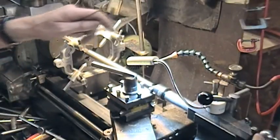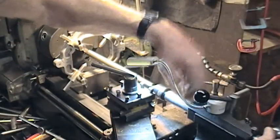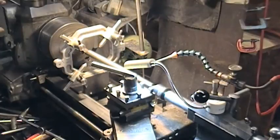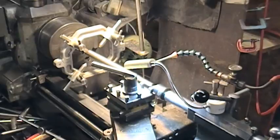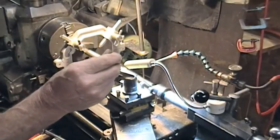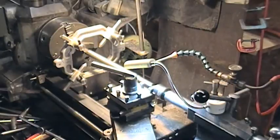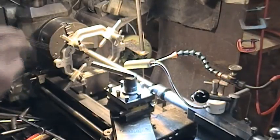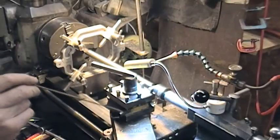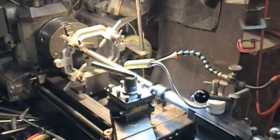I'm going to put the live center back in under considerable pressure, and now if we run it you should see the runout in the middle of the bar. The end here was dealt with first, just projecting out of the three-jaw because the rest of the material goes through the spindle. For this exercise we'll assume we haven't got the ability to go back through the spindle, so we have to work with an extended length and find a way of getting the work done on this end. We're going to set up the steady and mic up the runout.